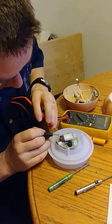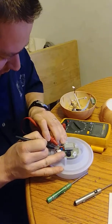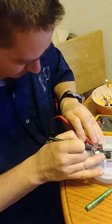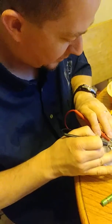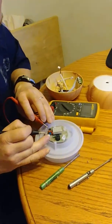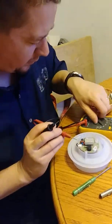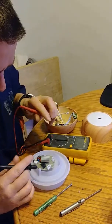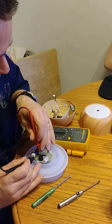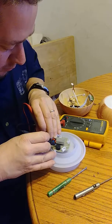So here's one red one. We'll go from here to here and it's reading a little bit — it says a few microfarads here. It did say 44 microfarads a minute ago. It's not really talking. This blue one didn't want to do anything. Going to resistor mode — this one should be about one ohm. Yeah, 1.2 ohms on that one.